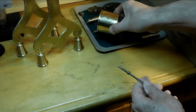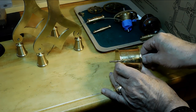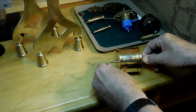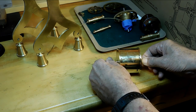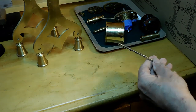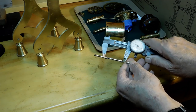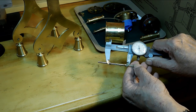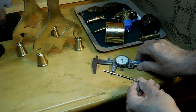Here's how you use it: you take your main spring barrel and insert the tool so that it comes out the other side. Once you've got it in there, you pull on them until they grab the sides and pull it out. Now we have the inside measurement, so we're ready to go to AutoCAD and draw our arbor — and that will be our next video, building the arbor.